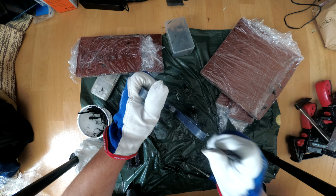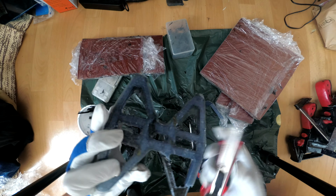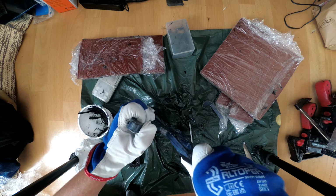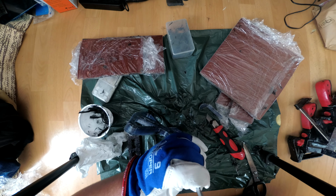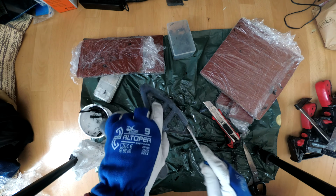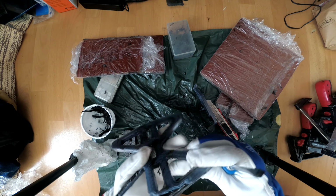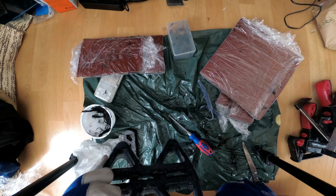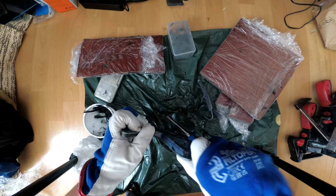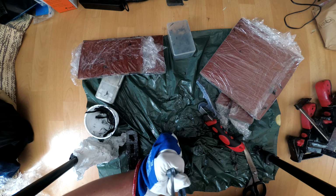Step 7. Cut the edge of the mold in the place that should be on the level of the bottom of the mold. You'll see what I mean. It should be visible due to the thin walls. Yes, I will sacrifice the mold because it is really hard to make a mold on a 3D printer that will not crack during the extracting process. It's better to print the mold with less material and just destroy it completely. Trust me, I have made many molds for this frame.